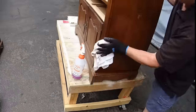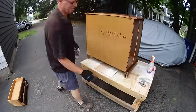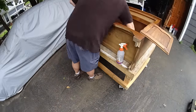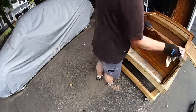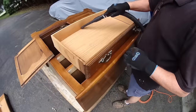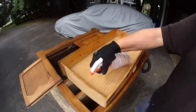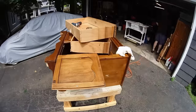That needed to be cleaned drastically also. There were mold spots on the sides — I was able to clean those off with Purple Power. You could see the split in the wood, and the bottom actually was a plywood and that was starting to split. I had to do some repairs on that. Once it was cleaned up and we took the doors off and got it ready to work on, I didn't want to keep that curved edge on the bottom because it just dated it to being a 1970s piece of furniture. And we lost those handles as well — the drawer pulls. Didn't like those.